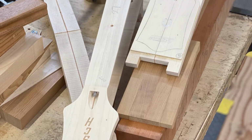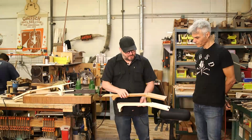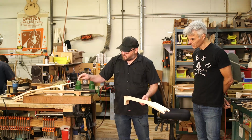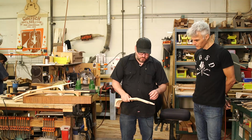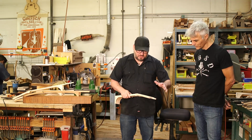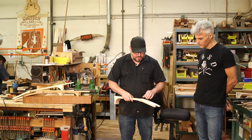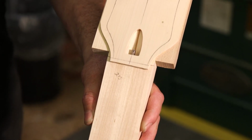All right. Once we hit the shaper and get the neck to this basic spot, the truss rod comes next. Install the truss rods and filler strips. After that, the neck extension also. This one doesn't have one yet, but that'll come later. The head caps go on next. Depending on the model, the year, whatever they want, if they have custom inlays, we do that too. Head cap goes on here. We'll trim the edge so we have a nice straight edge.